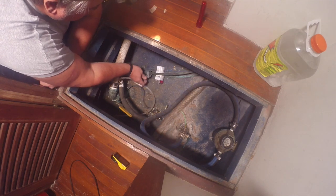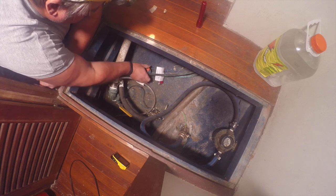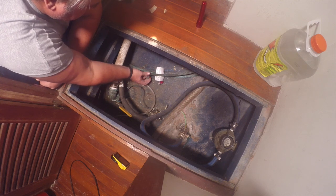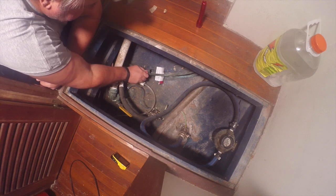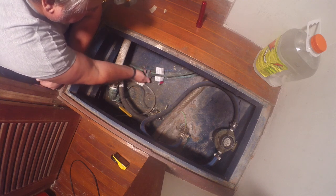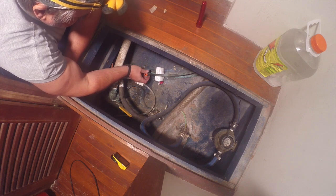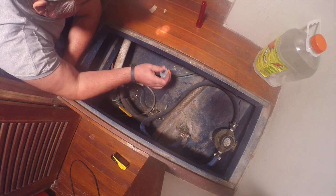Because this is going to be a fresh water flush system, we're tapping into the water line, exposing the bilge area for easy access. It's important to identify the correct line to cut — I ran the hot and cold water to the basin sink for a few moments so I could feel the temperature difference on the copper lines. Then, using a standard hardware store copper pipe cutter, I went ahead and cut the cold water line very slowly and carefully, rotating the cutter and tightening just a little bit each time. It's important not to misshape or crush the line since we're adding a T fitting here. Before starting, I turned off the fresh water pressure system and opened all faucets to relieve pressure — you can see some water still trickling out and flowing when the pipe is cut.